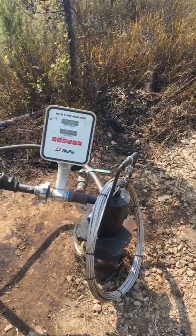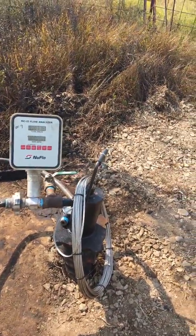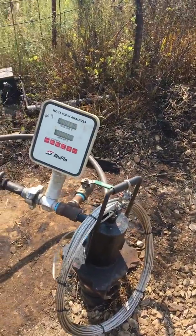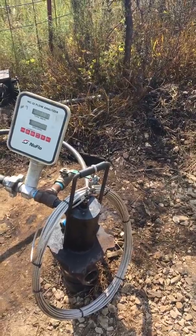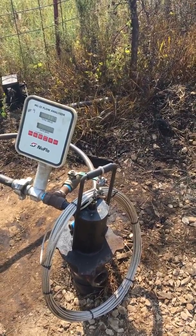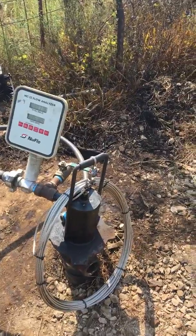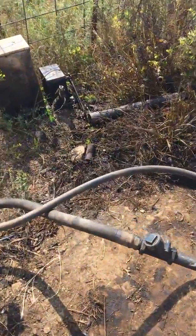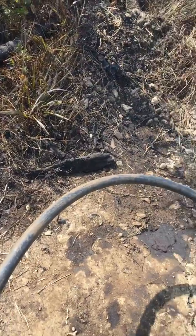That's the stainless steel cable that we use. That stainless cable attaches up here to the top and supports all of the pumps. In this case, there's four pumps in here and we're down 800 feet. It also supports the poly pipe — the black poly pipe that you see up here, the three quarter, this is what we use inside the well.